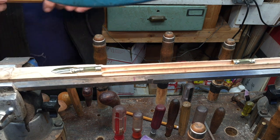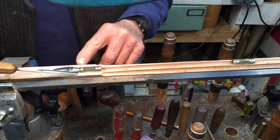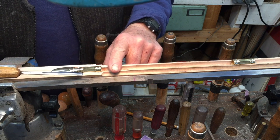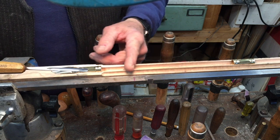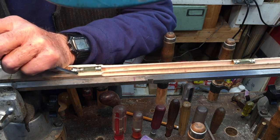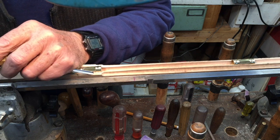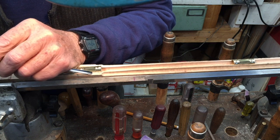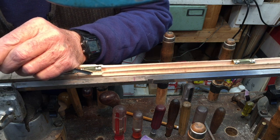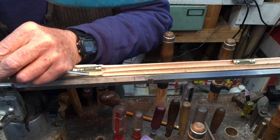All right, we're going to finish this molding down this far on both sides, and then we're going to lower the top of the loading stick molding down all the way back to here, down to the center of the flats. So we're going to take this off. Let's see, the grain is a little bit the wrong direction, so I've got to be very careful here. I don't want to tear out a piece.